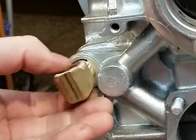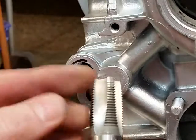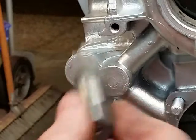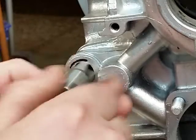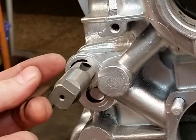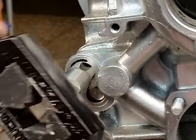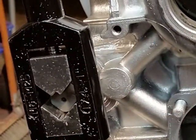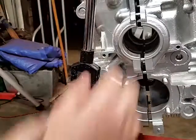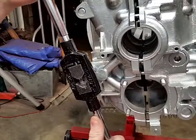What I'm doing here is I figured that as you tap this thing, it tapers and makes the hole a little bit bigger as far as the thread pattern goes. So what I've been doing is putting the tap back in and tapping it maybe one more partial crank. What it does is it just gets the threads a little bit further. Mine are pretty shallow — about a half inch — and there's more room to play. So as I put this in here, I tap it until I come to the point where it's resisting the tap, and that's where I cut another quarter to half a turn.